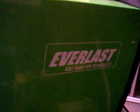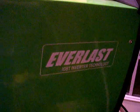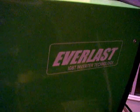So far the Everlast PowerTig 250EX has shown to run a very uniform bead, very stable arc, adjustable on AC frequency — you heard the adjustment — and it's also got pulse capability. Stay tuned for the next video and we'll talk about all the rest of those knobs.